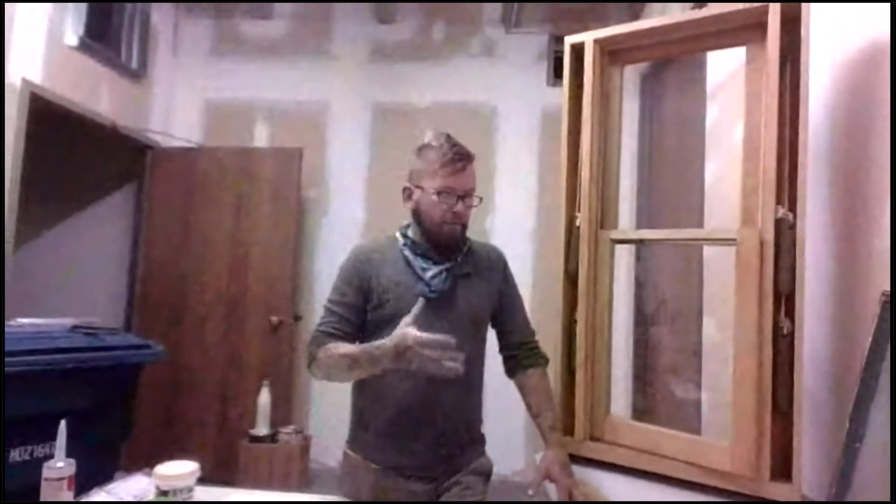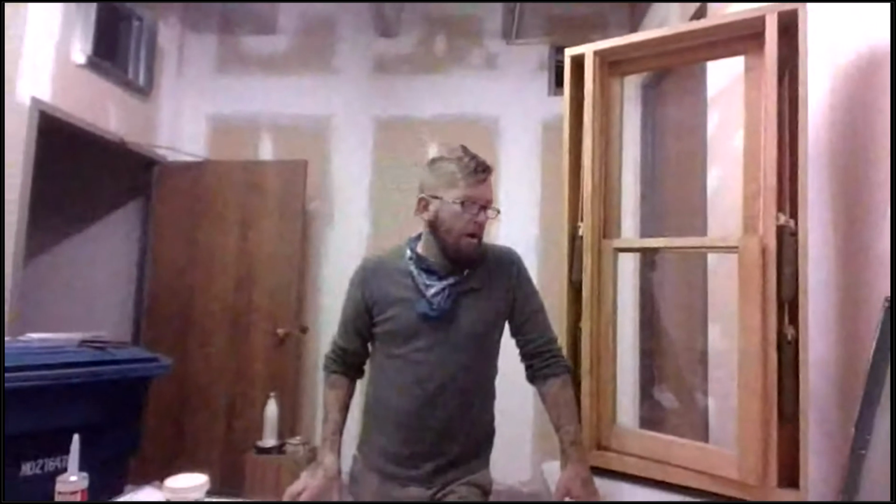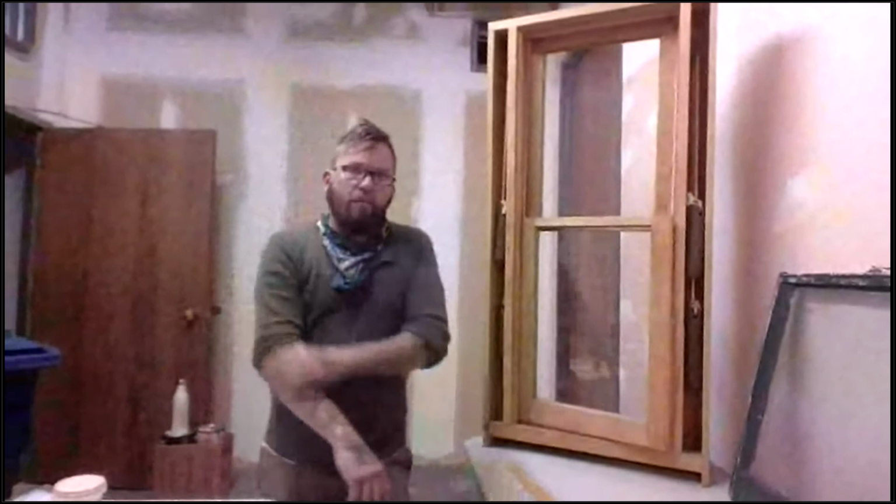Now, I have a lot of clients who are starting to get a little older, can't get up on a ladder to put those big old storm windows on. I believe that interior storm windows are an option that slide in. Yeah, if you look at the outside of your house, you can actually see probably brackets above your window that are great now for hanging Christmas lights. But changing out all your exterior storm windows can get harder as you get older. And not all of us have a 30 or 40 foot extension ladder to get the upper windows changed out. So yeah, they do make interior ones. They're spring loaded and they slide into your window frame, and that'll double as a storm window so that you don't have to go outside and climb a ladder and pull your wooden ones off.